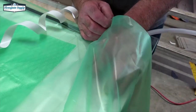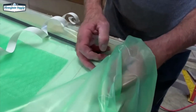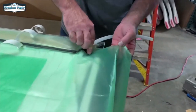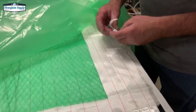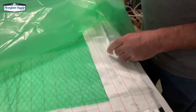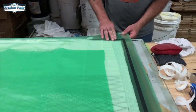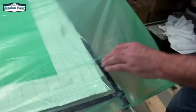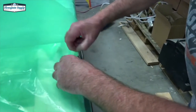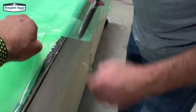One of the nice things about infusion is we can make adjustments. Our peel ply had gotten flipped up and the hose was laying on the fiberglass instead of on top of the peel ply. We're using MTI hose for our vacuum out — that's a Gore-Tex membrane over a spiral wrap. When resin hits it, it won't go into our vacuum line or resin trap, and it allows the resin that hits it first to stop so resin in other areas can catch up. You do need to tape the ends on your MTI hose to ensure no resin can get in and to maintain a good seal.